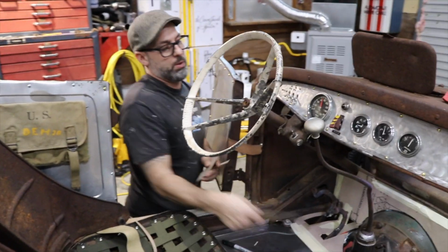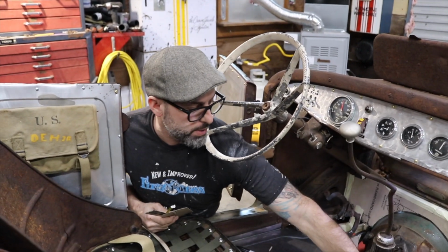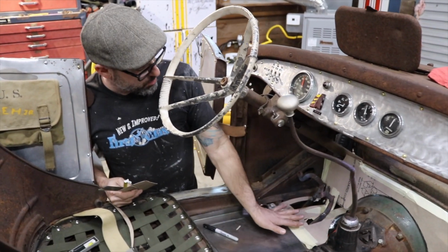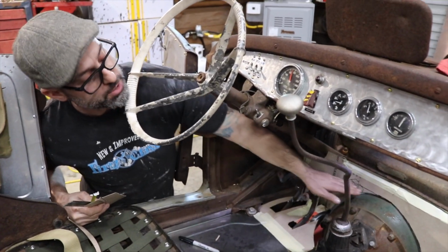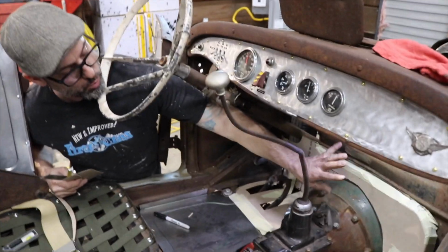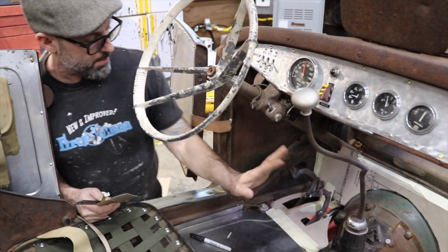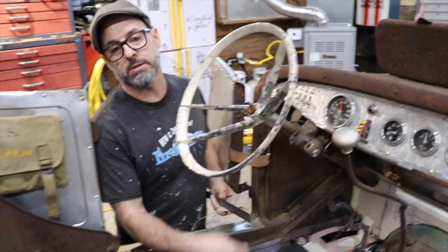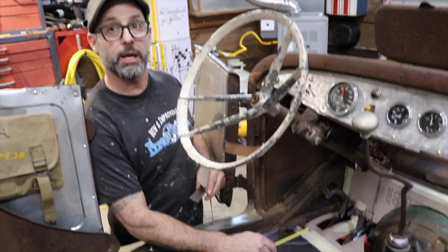So what I'll do next is I'll get this separate piece built out of sheet metal. I'll do this separate piece here, and then this front piece will be one piece of sheet metal. These two separate pieces will be one. And then once they're all said and done, I'm happy with it, I'll get everything drilled, punched, and then welded in place. And then that'll be it.